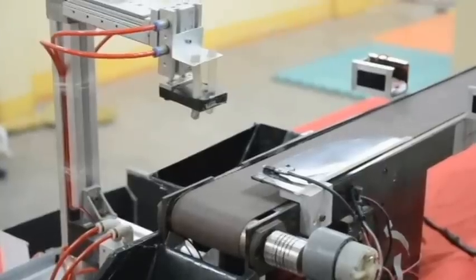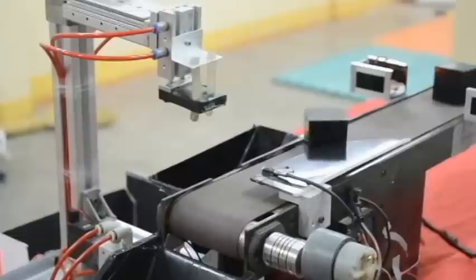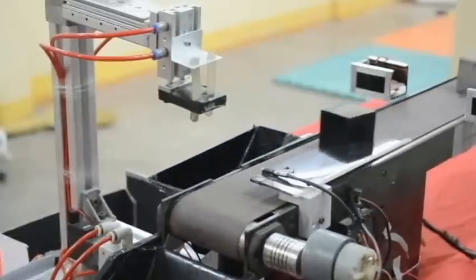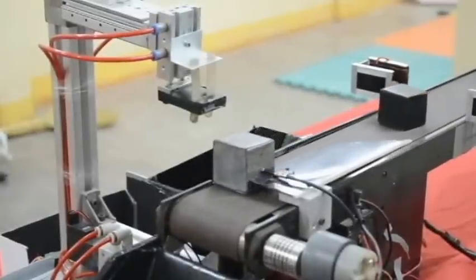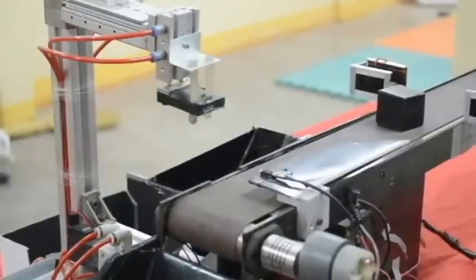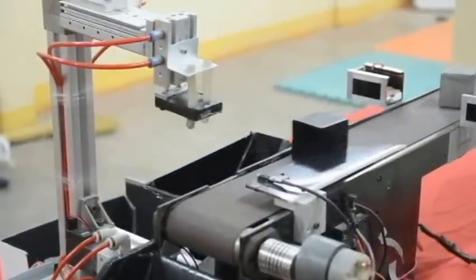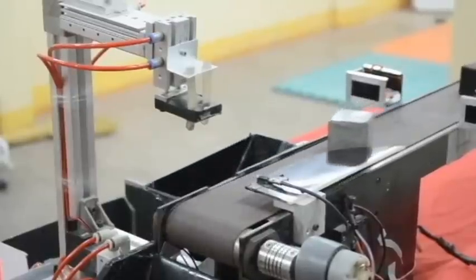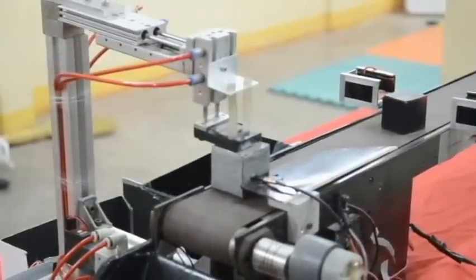The object in the conveyor will pass through another sensor, which will detect if the object is metal or not. If metal is detected, the sensor will send a signal to the PLC, which will activate its operation. The PLC will first command the conveyor to stop moving. Then, a pneumatic cylinder with a magnetic plate will lower down to pick up the material and drop it into a funnel, which will lead to the storing process.